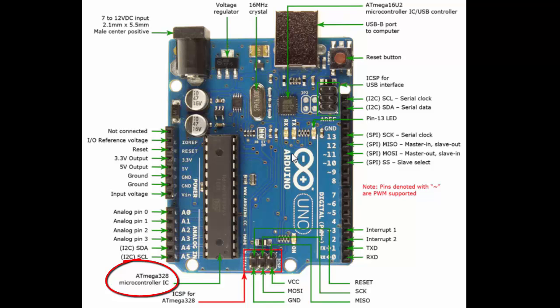The microcontroller is the heart — it is like a PCB with your processor. The difference between microcontroller and microprocessor you will learn in academics. This board uses the ATmega328 microcontroller — fix that in your mind. Additionally, they are using the ATmega16U2 microcontroller, which is used as a USB controller. The ATmega328 is the heart, and the ATmega16U2 is needed to connect your laptop or PC to this Arduino board.